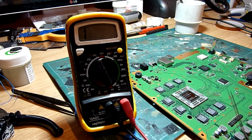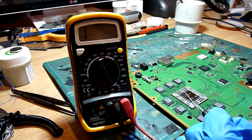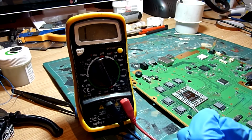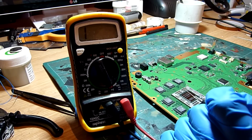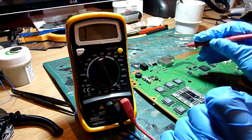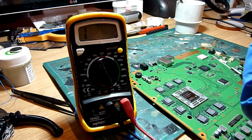That's basically the mode which causes the multimeter to beep whenever the probes are touched together. So what we're going to do is go through the back of the pins. Now then, if you have a look at the HDMI pinout video we did, which gives you the alternate points for the HDMI, we're going to check each pin at the back of this port to its corresponding point out of the board. I'm going to make sure that the port actually has communication and continuity with the actual portion of the circuit it's supposed to do.